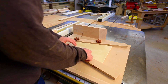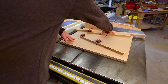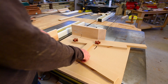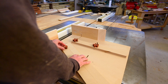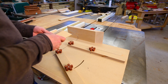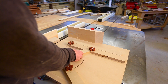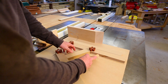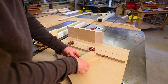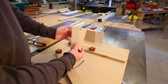If I set the wedge so it's even to the blade, I can cut a long segment and that segment will fit between the two fences with the correct angle. Now if I reset the fences with that same angle but not even about the blade, and recut a new segment based on that setup, that new segment also fits within the fences — and so does the old one. If you line up one end, the other ends are parallel, so it's still making the same segment as far as the angles on the ends go.